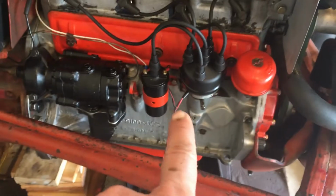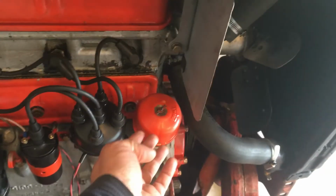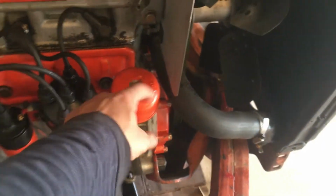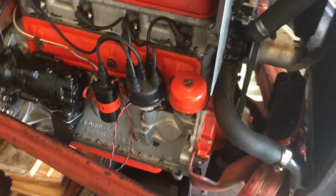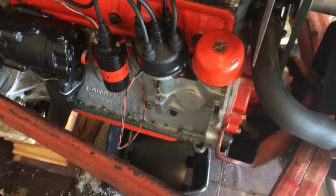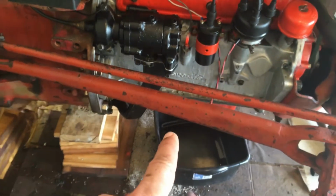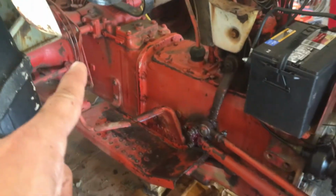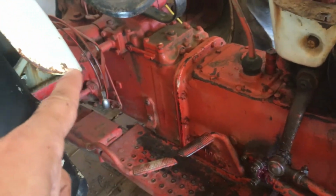The second thing is engine oil, which you put in from here. This is the place where you fill, and you take it out. It's a pressure fit, but you can remove it by hand without unassembling or using this butterfly nut. You can simply grab it and pull it out, but it sometimes hurts if your finger grabs the sheet metal or anything. That's one thing, and you can drain from the bottom, as you already know. However, the plugs are the same kind of plugs for the transmission, the hydraulic, and the differential.